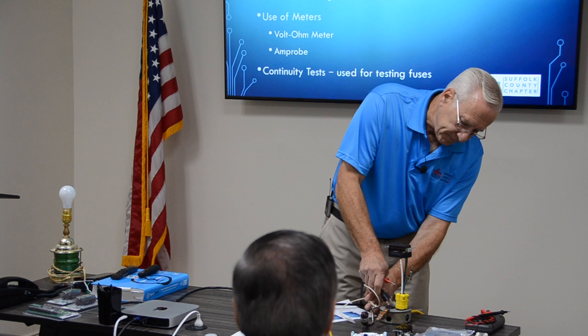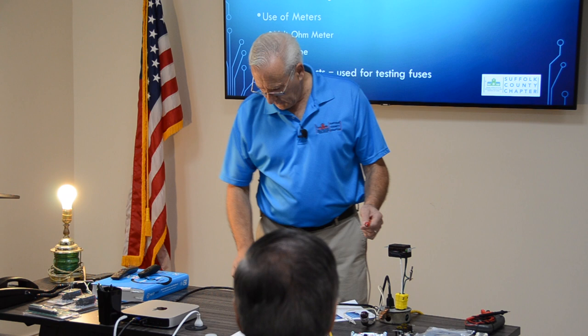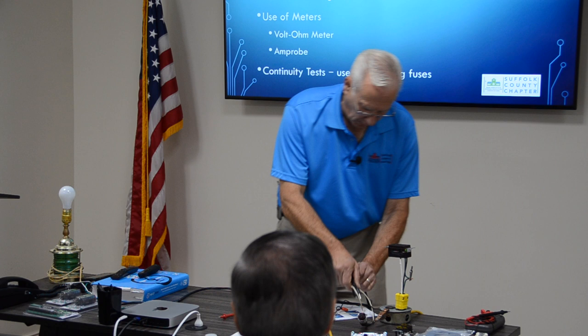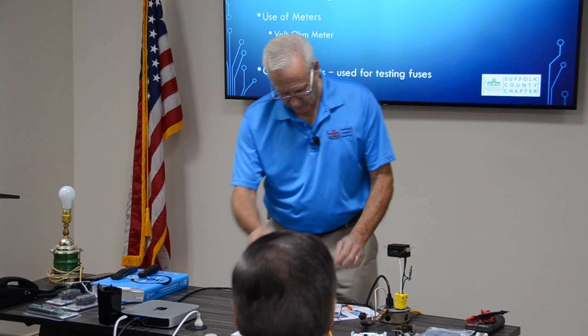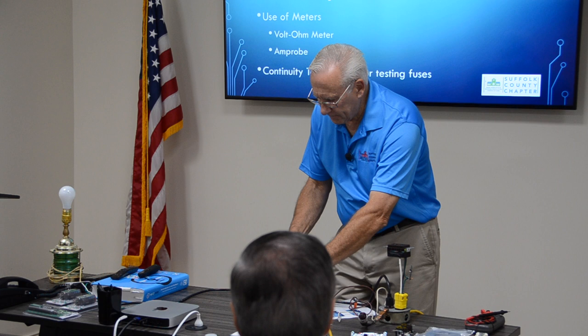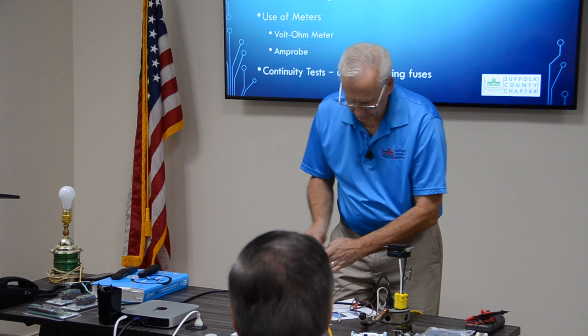So, we have the light, it's plugged in, the receptacle here, everything's good, right? Now, I'm going to unplug it for a second. I'm going to disconnect the neutral. We have a broken neutral in the line. Now, the light's not going to work. Am I right? No, the light's not going to work. We have no power there. We'll do this, light comes on, right?